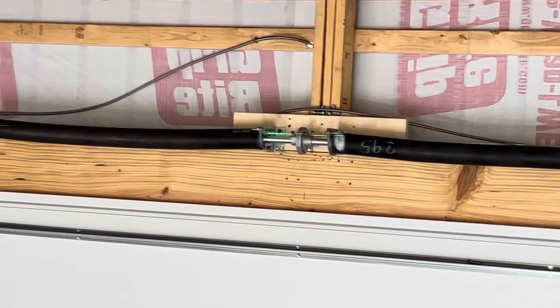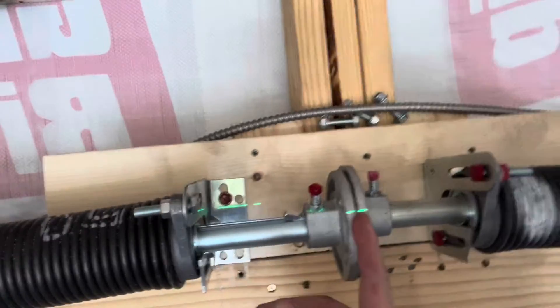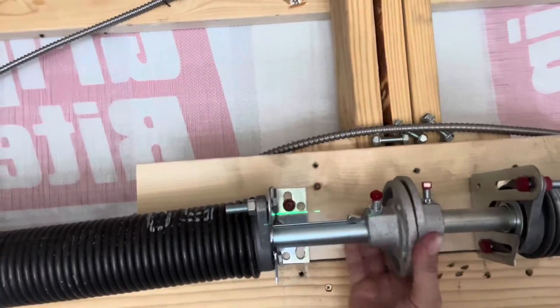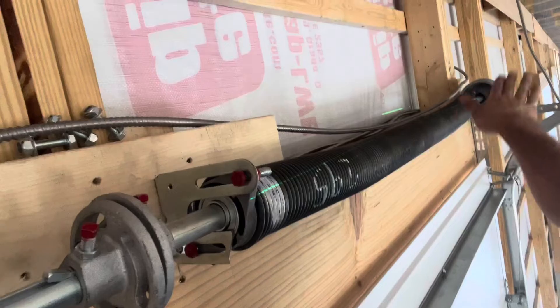I'm off. So here's my thought process — now it's coming to me. Why you can't always just use a laser: it's because you'll start getting a gap up in this top if you make it with the laser, the shaft. The reason being is because the weight of the spring makes this shaft actually belly.